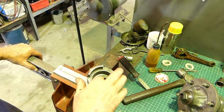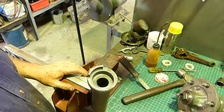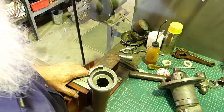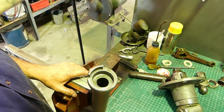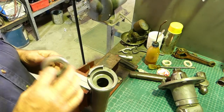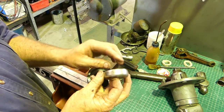Just for interest's sake we'll grab our kingpin and see if it fits - it's close but just a little tight, so we might run a reamer down there. We've got both bushes in and I'm going to grease them up a little bit first. I think we're close enough that this kingpin will probably sit in no worries - we may have to bump him past this little rough pit up here, but we'll give it a go.